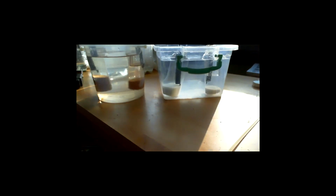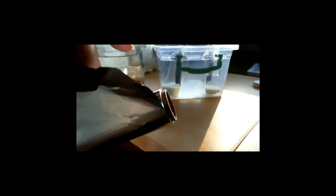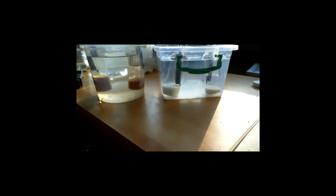But of course, you can use normal food grade one, but this is much thinner and you have to put more turns. When you make your capacitor, before making it in a real way, just make a model to see how long pieces of paper and aluminum foil will fit perfectly without forcing it inside, because we don't want to damage the nano coating, and without having too big a play there. So I set these two experimentally.